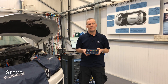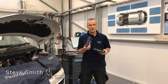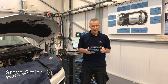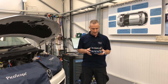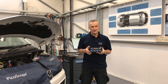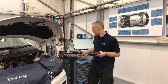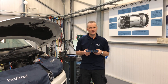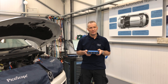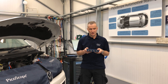Hello, my name is Steve Smith and I'm an Automotive Application Specialist here at Pico. We're here to look at the new 4425A scope from Pico. Here's the existing, outgoing 4425 scope. Specification-wise they are identical: 400 million samples per second, 250 million sample memory, 20 megahertz scope, and 12-bit resolution.